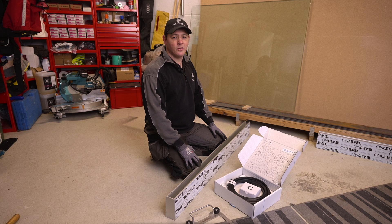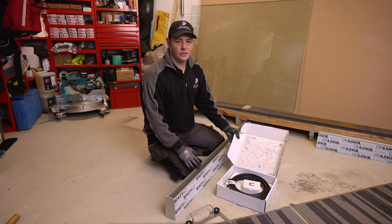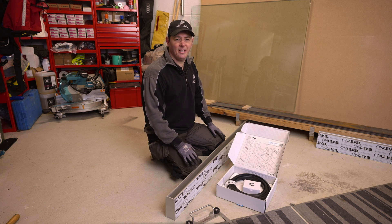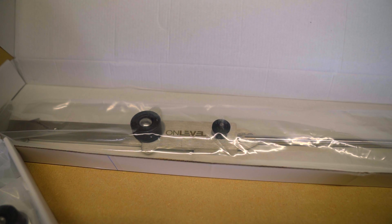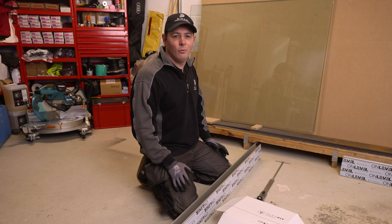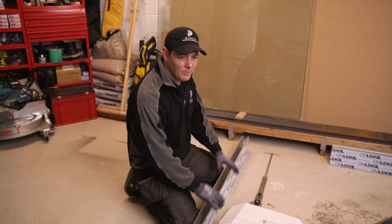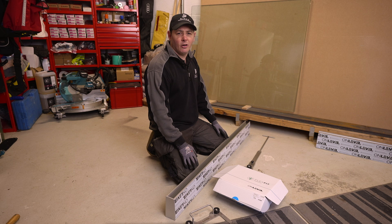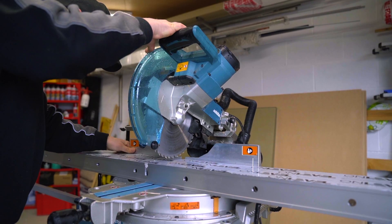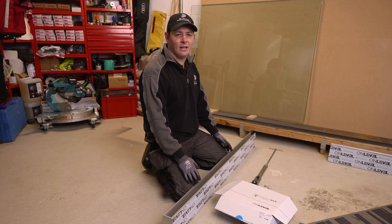One huge benefit of On-Level products up to 1.5kN is that they have the same mounting system across the range to suit 12mm to 21.5mm PVB — this is called the flex fit system. This means that specific tools needed across the systems only ever need to be bought once. The main benefit of this wedge system is time saving; being one-sided, the installation process is massively reduced and simplified. The fixings on this particular system are 300mm centres, but most of On-Level's tracks have been tested for 200, 400, and 600mm centres, so you can use the same track for different loadings.